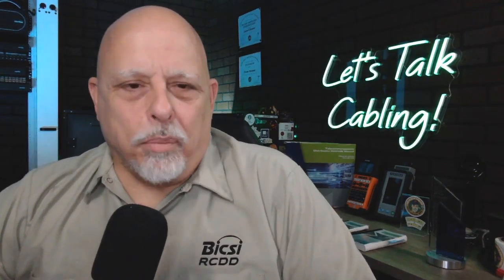So you have to make sure that the software is set to either single mode or multi-mode. Also, if it's going to be 900 micron cable or 250 micron cable. The 900 micron cable is going to be your tight buffer cable. The loose tube is your 250 micron. And you set that in the profile and it does everything else. Yes. Also, the holders for those particular fibers are going to be different, so you have to have the right holders for the right cable as well.